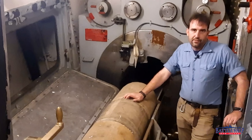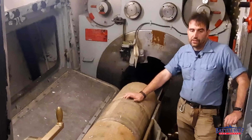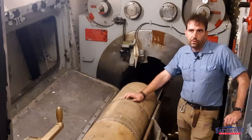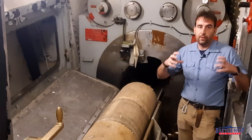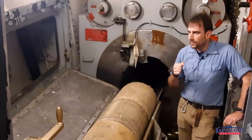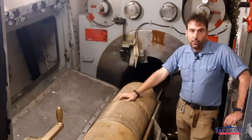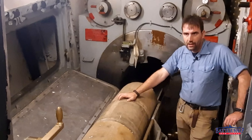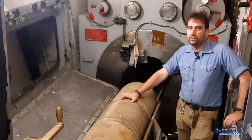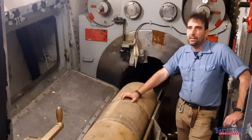The shells for both the 5-inch and the 16-inch guns are a different matter entirely. How do you get those out? And I don't believe you can. Each shell has a brass base ring near the bottom of it, and that ring is a little bit wider than the diameter of the shell. The idea is when you ram that shell in there, you're trying to push it in so hard that the base ring engages the rifling. So at that point it is pretty solidly in the rifling of the gun, and it's probably too far in there for you to just grab.